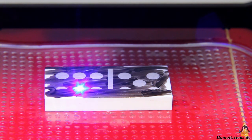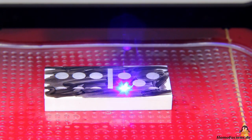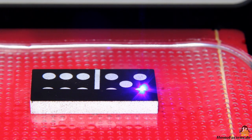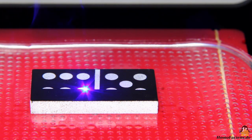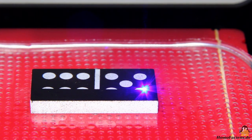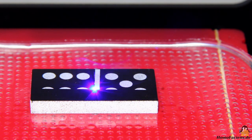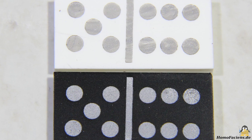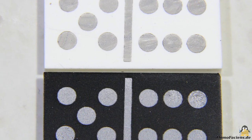Covering the surface with black paint is also needed when engraving highly reflective surfaces — here I'm processing white plastic. If you spray permanent color on the surface of an object and remove it with the laser, you get a negative of the bitmap pattern. The burn time to remove the black paint is significantly lower: only 15ms at 70% laser power. The results of both variants are pretty good.